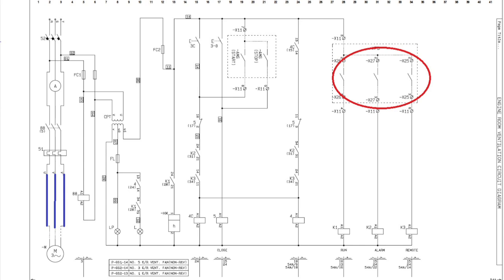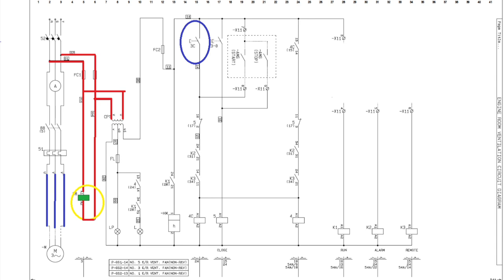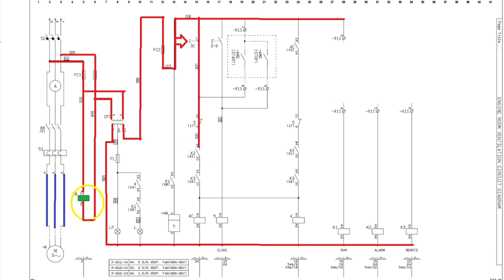This is the fastest way — removing all VFD connections is the easiest modification approach. Following my conventional troubleshooting method, I read the wiring diagram from supply all the way to the load. In this circuit there are no controlling contacts on main contactor 88, so finding a controlling contact for it is the main goal of our modification. When we push start button 3C, current flows through the circuit.